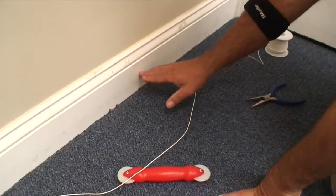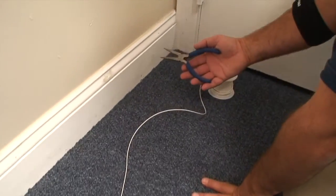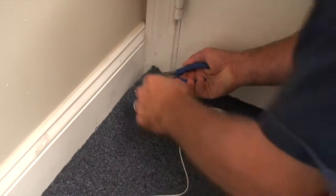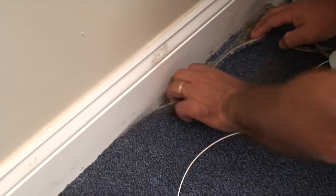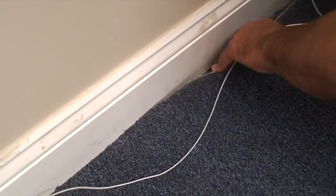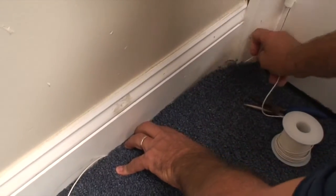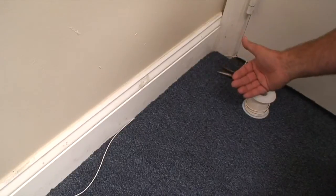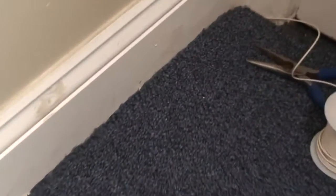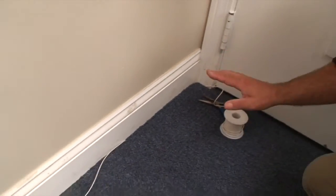When we have a home or office installation but no gap from our trim to our carpet — the carpet's tight up against there — we'll take a pair of needle nose pliers and simply pull the carpet back. When it's glued down like this, we can work it nicely with our hands, then take our wire and simply get it tucked in behind there. It's going to disappear absolutely wonderfully. When it's glued like that, it re-adheres very nicely. If needed, we can use double-sided tape or some glue, but typically we won't need either.